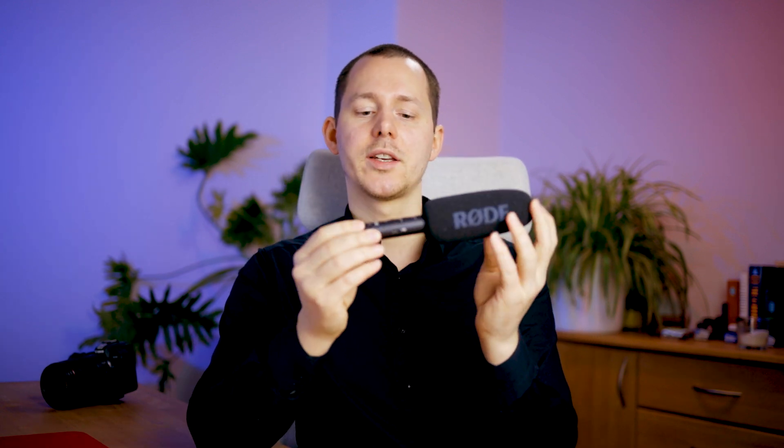That's something this little adapter right here handles — I've been using it for about two years in different setups. Some microphones actually have feature sets where they provide two different signals on your camera, using the left and right channels to separate those signals. One of those is the Rode VideoMic NTG, which has a feature where you can turn on a minus 20 dB pad between the two channels — a safety track for post-processing in case the audio clipped.